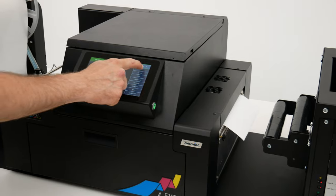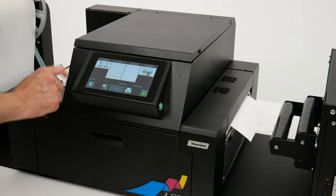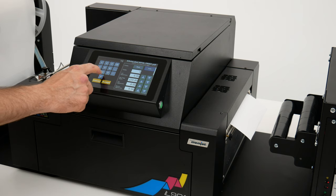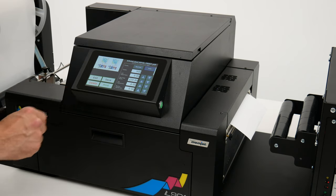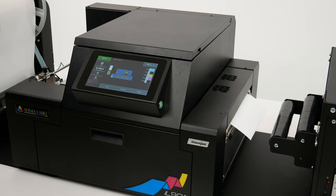You can use the touchscreen display to reprint artwork that was previously sent to the printer. To do this, select your stored artwork file and enter the number of copies — we'll go with 500 this time. Most crucial driver settings are available here, so it's very useful for repeat jobs. We'll choose Best Print Quality for vibrant colors and optical density, and with the unwinder switched on, hit Print.